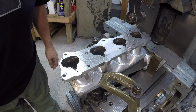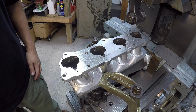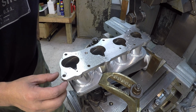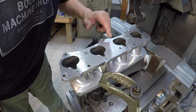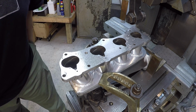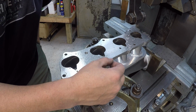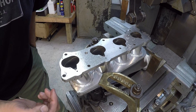That's the end of our two cuts, both cuts being 10 thousandths, and in the last cut there I slowed it down to a 10 thousandth step over, which is the slowest that the table will feed there. But I actually think it looks really good, and I don't believe I'm going to do any more cutting on it. I'm not even going to worry about the shear tool, because that is a beautiful finish on there, and it cut it from end to end.